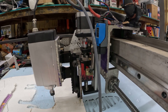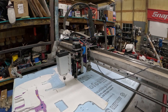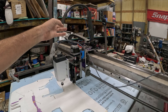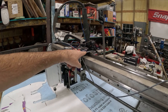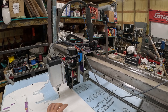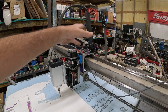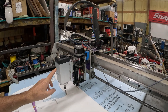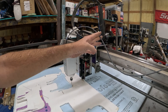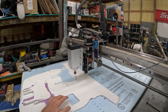I have a functional Z-axis. Because this wire is hanging out in the ether temporarily — you don't want to undo the cable chain every time and take the torch out — I put another small Picatinny rail up on the top to mount the torch head stationary and out of the way. You can unplug right here. I wanted to get my proof of concept down first to make sure everything was going to work properly.